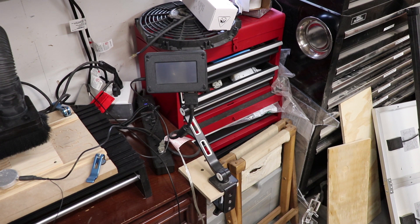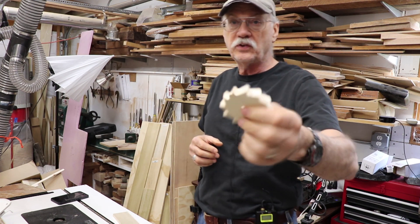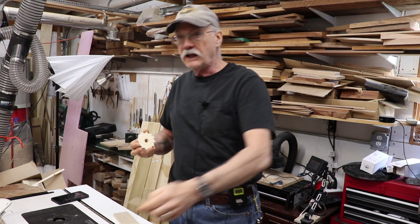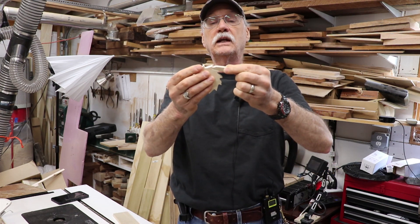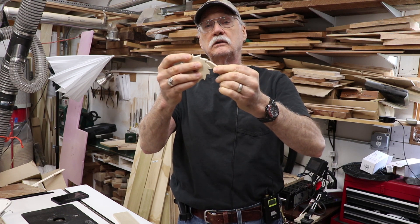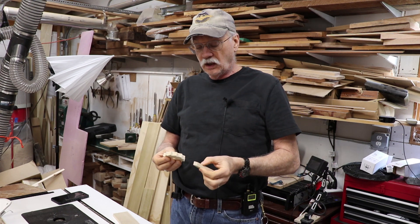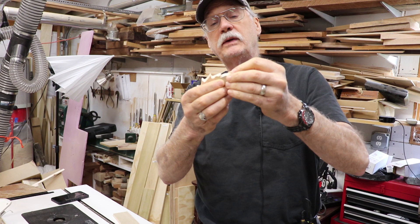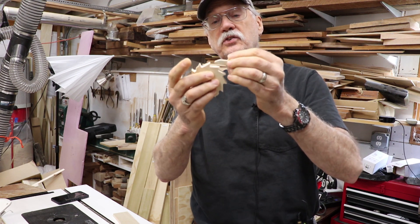It's in the shop now and we are having fun. Earlier in the video we showed you a test cut of a gear that goes on the tape loom. Here's one of the finished gears — this is half-inch poplar. It goes on a shaft and allows you to lock the tension on the threads in the loom. We also cut out these pawls that fit nice and neatly into the gear, and you just lift it and move it to tighten up your threads. We do ten of these at a time on one piece of wood, and they fit really tight because I took this portion of the drawing and added it to this portion — it's a perfect fit.